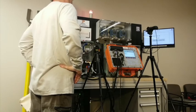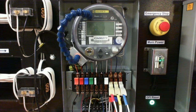So we typically isolate, right? So we're going to open up our voltage switches and we're going to provide the voltage with the test kit. Okay? And then we will run a phantom test on the meter. And when we run the phantom test, you're going to see it here in just a minute. Normally when you run a phantom test, especially out there in the field distribution, you use the potential there at the site. So you would leave the setup with 0 volts. But when we're at a substation and we're going to open everything up, now we supply 120 volts with the test kit. So it looks like a little different setup because I've got to put 120 volts in that column for voltage in my phantom load setup. All right? So we're going to talk about all that as we go along.